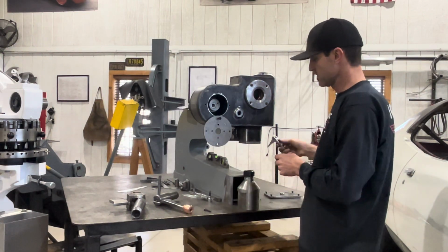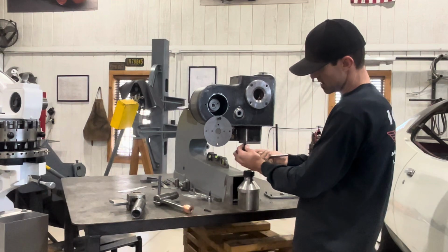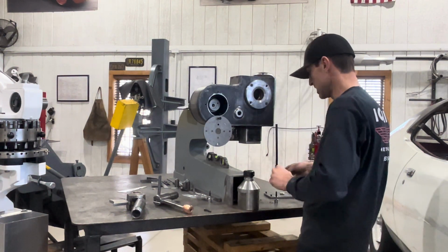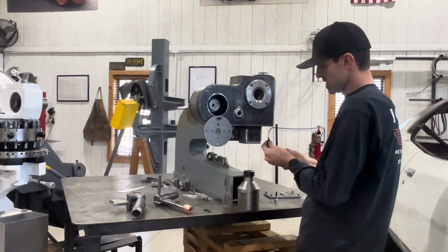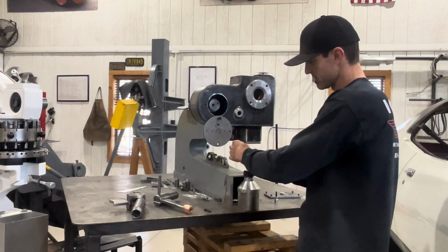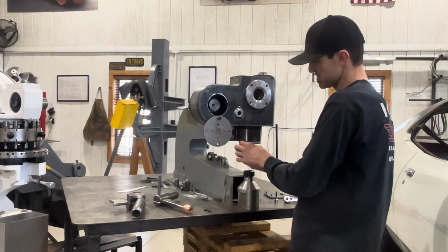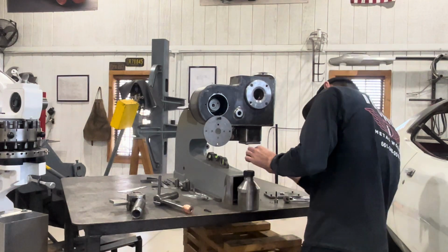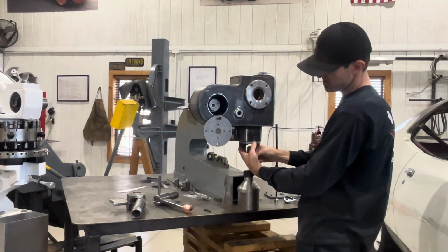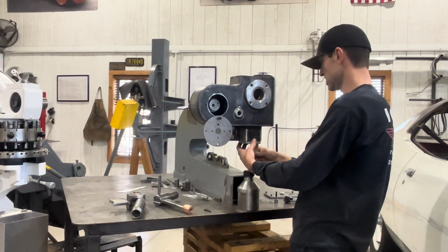This thing does have seals inside. I machined this, and I decided to do a double seal, which I don't know if it's necessary, but I just like to do some overkill. And I'll show you. So there's a seal that's machined in this square bore, and then I got the wild hair to basically machine this cap to keep in the seal that's in there.